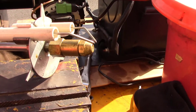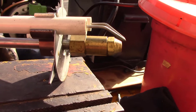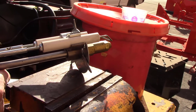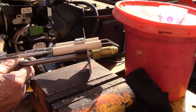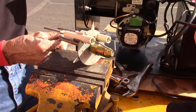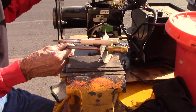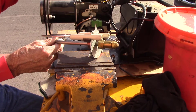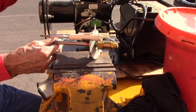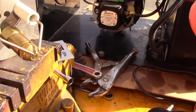Also pivot the electrode to make sure it's set at the proper distance from the nozzle. The nozzle on the front should also be inspected — it just screws out of the brass housing. There is a small filter on the back of the nozzle that should be checked to make sure there's no residue blocking the flow of fuel. These nozzles should be checked at least once every 500 hours or once a year. There is a number printed right on the nozzle — make sure you have the proper nozzle for the size of machine you have.